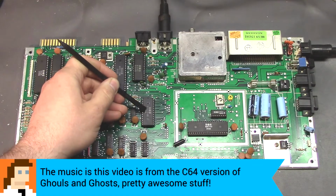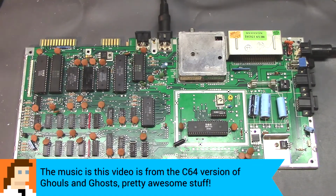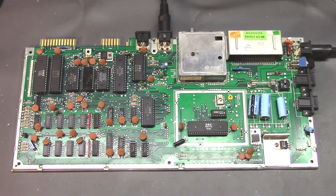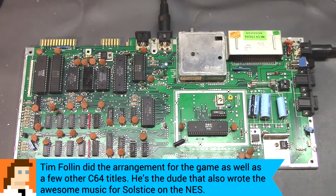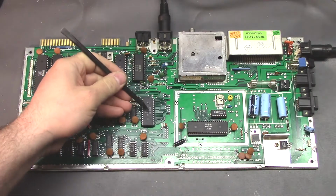It's a little synthesizer chip that was specially developed, and actually until recently I guess has been pretty hard to emulate. It does 3 synthesized voices, has 4 different types of wave, triangle, square, some stuff like that, programmable filters, and a whole lot of other features that really give it an awesome sound.